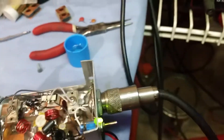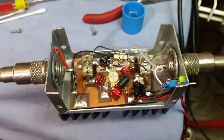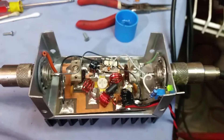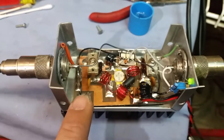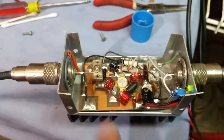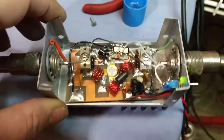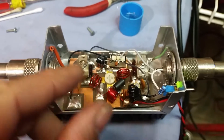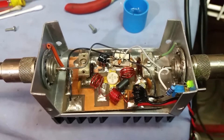I had to put a relay in there so you can actually use this thing with a transceiver. You've got your on/off switch right here. I got this tuned out - I went with these skinnier trimmers because they fit in here a lot better than the fatter trimmers. I also cleaned the box up for you. These are sensitive - you get in here and start moving these coils, squeeze a coil a little bit and the box can completely quit working because it's out of tune. That's why these are called tuned circuit amplifiers. We've got the 250 watt slug in.